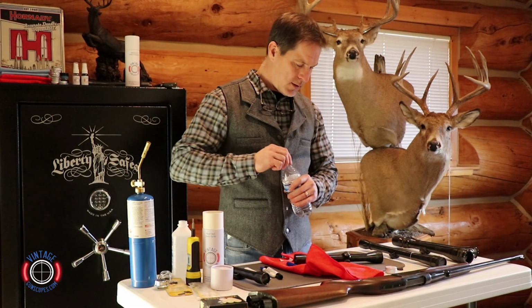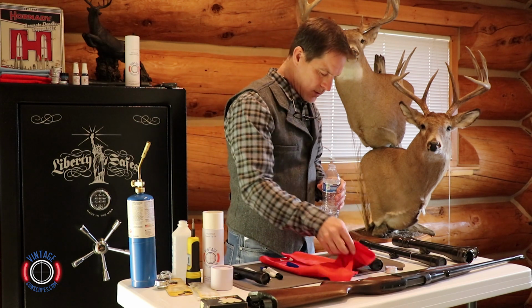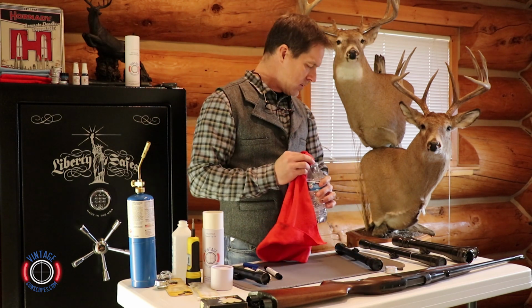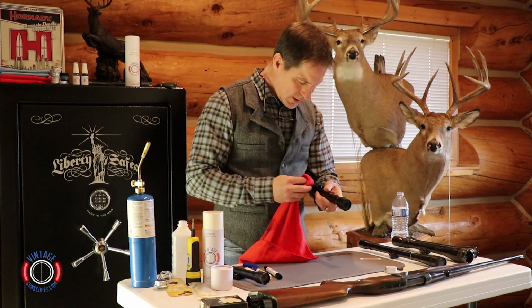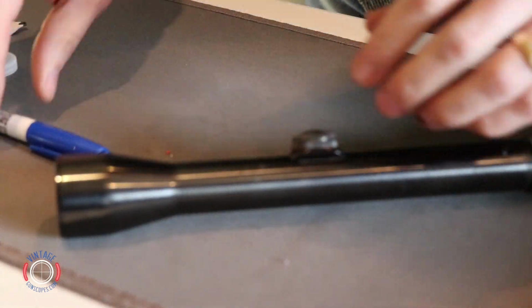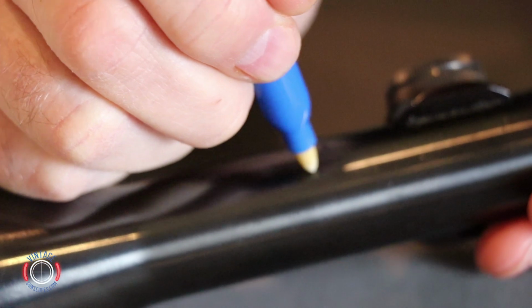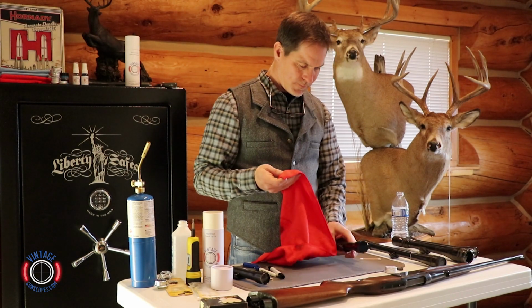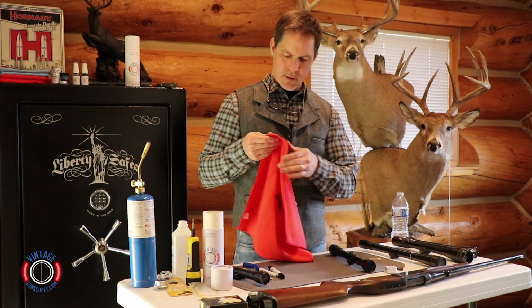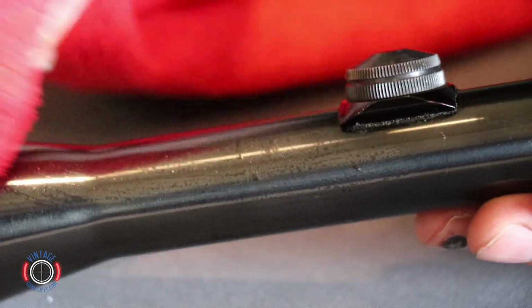And then we will use some cold water to wipe that off, neutralize that bluing. We're going to do this a few times. We're going to put a few coats of this on, because we want this to stand up and be protecting this spot for years. This only takes a few minutes, so it's not like it's a big process. Let it sit a minute. And then cold water again to remove it. Okay, and we'll do this a few times, 6 or 8 times, depending on the scar.